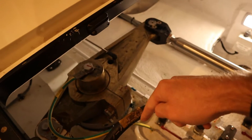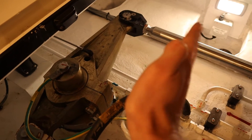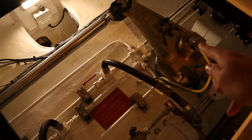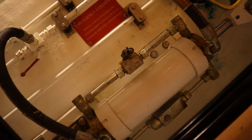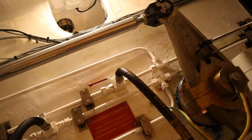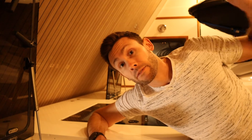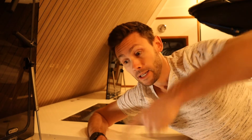Just imagine that's a vertical post going straight down and the rudder is connected to that post in this plane. So one ram to the starboard hand rudder, and that's connected by a bar all the way over to the port hand rudder which is also being powered by its own ram here. In the event that both of those pumps stop working we have to switch over to the emergency steering system, which basically means isolating those pumps. Because the system is bigger it needs those pumps to give you that pressure to allow you to have the helm all the way up on the bridge and the rudders back here.